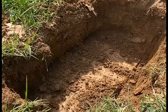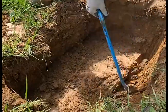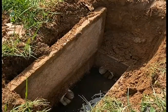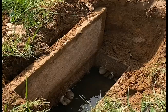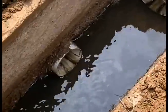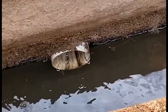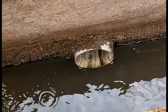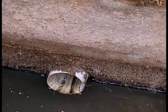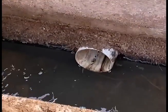The goal of the distribution box is to equally disperse the liquid into all of the drain fields. In this particular circumstance we have two drain lines. We'll actually see what's inside. This hook I'm using is also a TNT product. We can see we've got the two drain lines. As we look inside this box, we can see that a little bit of roots and soil is coming in from where the box wall and the drain line pipe meet. These boxes in our area generally last about 20 to 30 years.